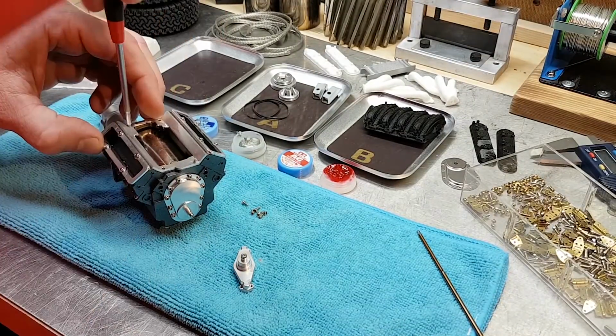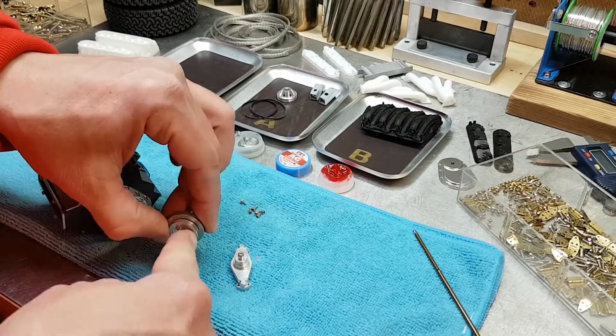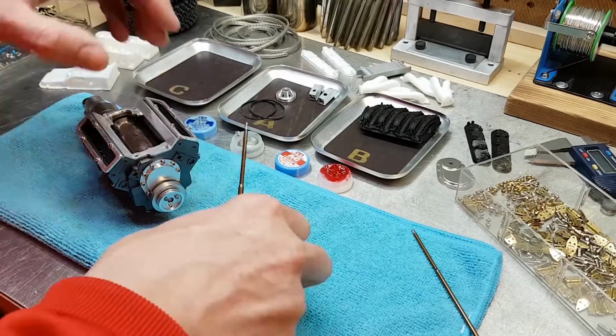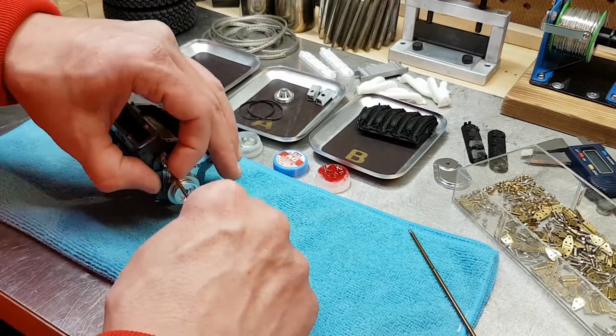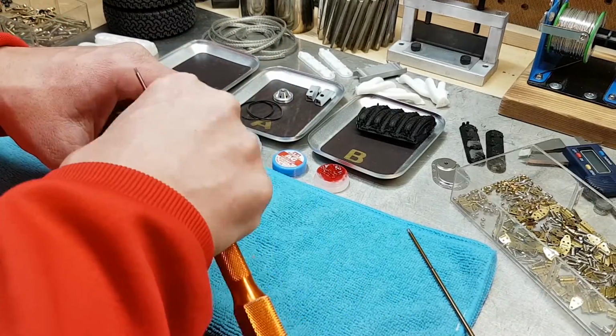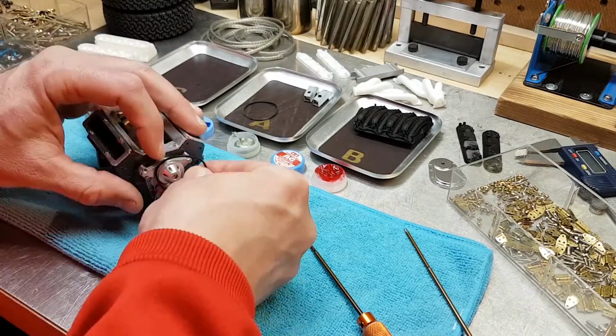Now I know that the timing chain cover is completely inaccurate, but I'm using the harmonic balancer, crank pulley, and accessory pulleys as a reference just so it gives me an idea how much room I have to work with between the block and where the radiator will be. They also look kind of cool on there while I build around them.